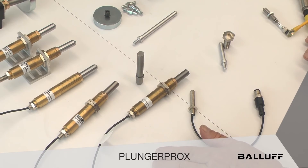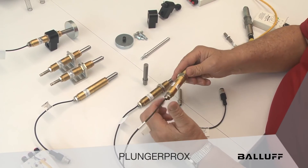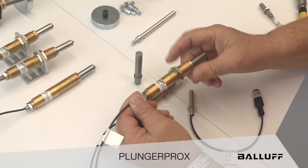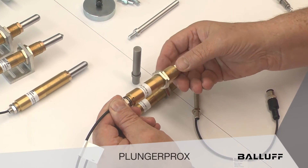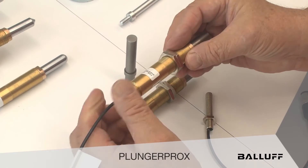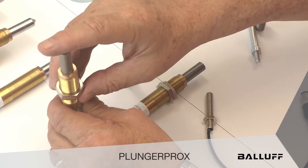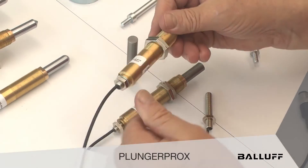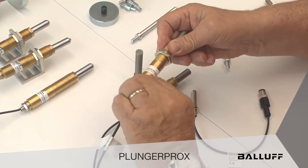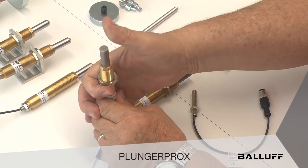Let's talk about actuation point. We have some of these pre-wired, and the way we make this work — we'll back the sensor out and you'll hear the tester come on. If you want a very light trigger, just rotate it out about a millimeter or so and it actuates very lightly. If you need less sensitivity, thread the sensor out a little bit more and it will activate further down into the travel. But you still get over-travel, so you're never damaging a sensor.